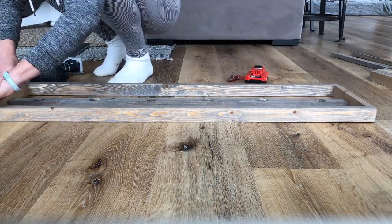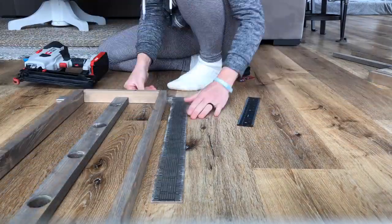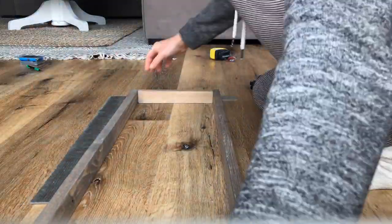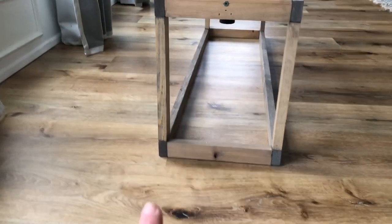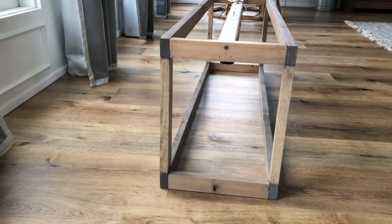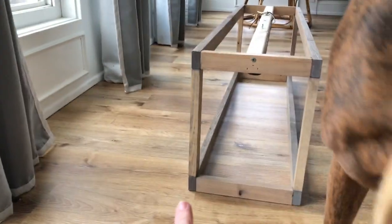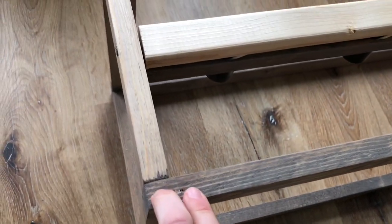I'm lining up my pieces, putting the prettiest sides out in the directions I want, trying to hide the uglier sides, making it match up. I'm using the wall as my sturdy flat base to nail gun against and I also have my right-angle straight edge. Here's another look at how it's constructed — and the rough edges stay a little different from smooth edges when stained and it looks so cool. Each place I used the nail gun I did two nails in each little spot.